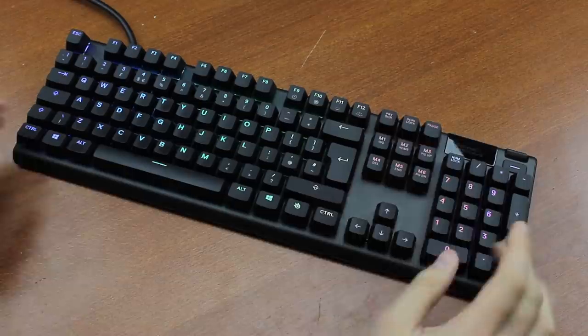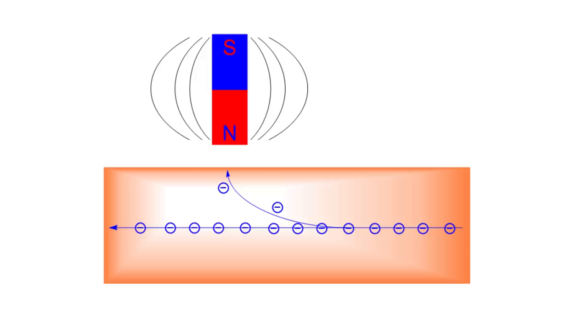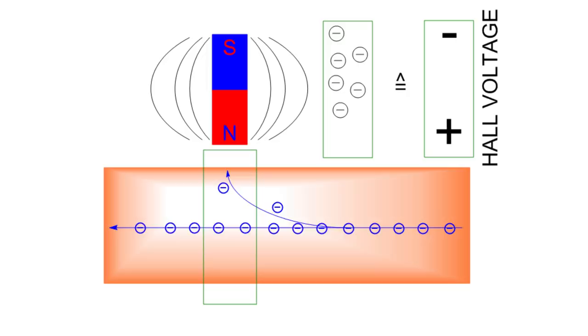We'll kick off with the switches straight away, the Steelseries Hall Effect OmniPoint switches. I've covered the Hall Effect before on the channel, and if you want it explained in more detail, please watch my ITT Courier video linked in the description below, but in short, it's an effect that happens when you introduce a magnetic field to a flow of electrons. See, magnets can actually bend electrons off their path, which you can measure as a transverse voltage, usually through a semiconductor cell called a Hall sensor.